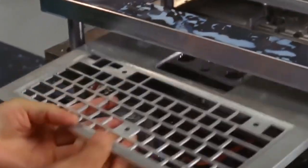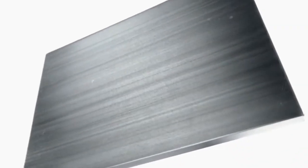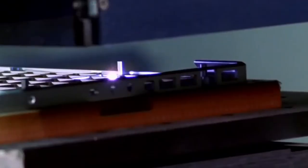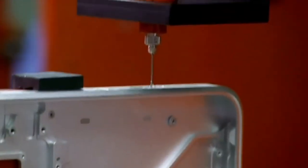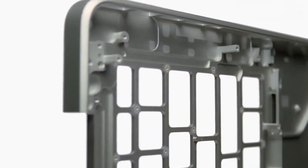The entire process is done in 13 different steps, each growing in refinement — so much so that the final refining touches are done using a diamond, so even the parts that join together later, like the bottom plate, don't have any major gaps between them. Once this is done, a laser is used to add tiny holes to the material for the speaker grills and notification lights. After that comes the final part of making the chassis: the finishing. The marks left by the machining are smoothed over, and the classic Apple texture is applied to each surface using a variety of sandblasting and chemical etching techniques.